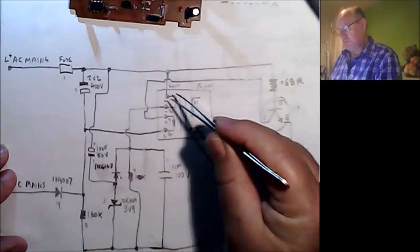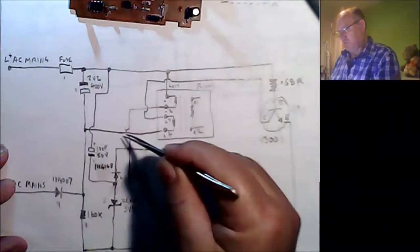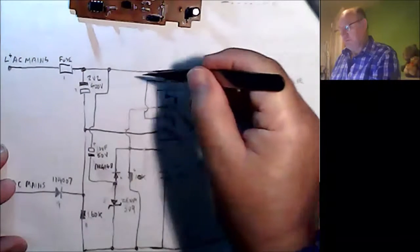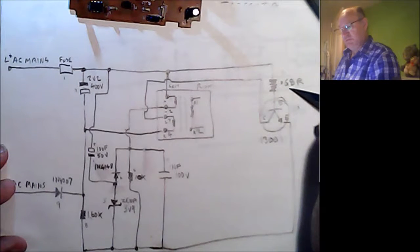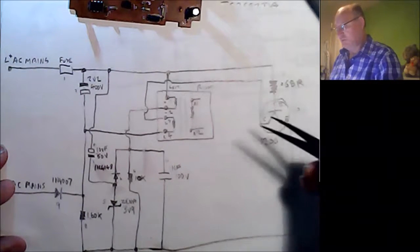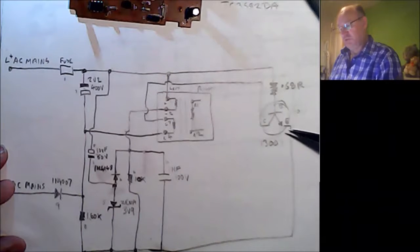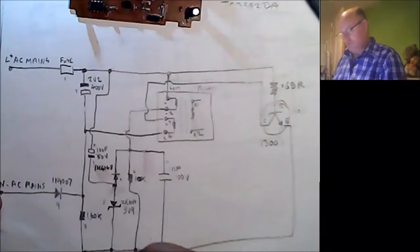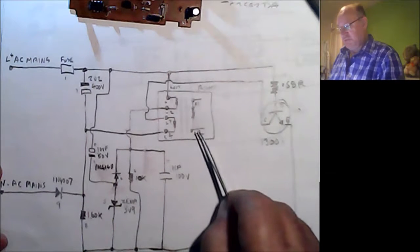And obviously if the power's coming through there, this was connected to this point, which is your negative half cycle, through there, back through to the collector of the transistor, and permanently biased with a 0.68 ohm resistor. And I say permanently biased, but it's not. It's half cycle permanently biased. So every half cycle of the mains, it would be biased on, because this is an NPN transistor. Obviously, current flows through, back, round, down, energises in that, causes energy in that, and these feed out to charge the battery.